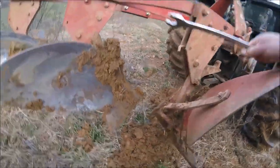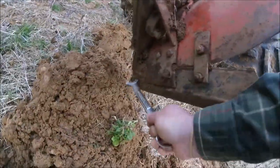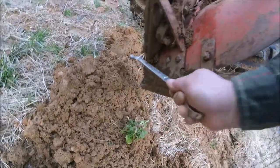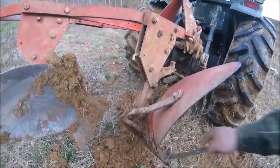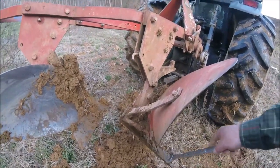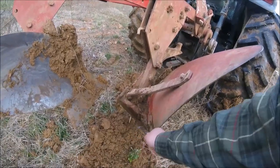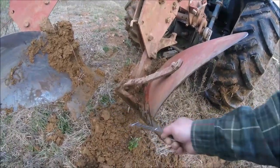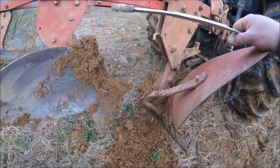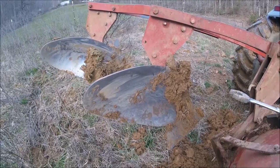If you go out and buy a set of used Ford plows, right here is your frog and you can look and see how much it's worn. This is your landside and that's going to need a landside. We've got to get these parts in for it. But some of these Fords had different bottoms on them — some of them used the Oliver point plowshare versus the Ford, so that's something else to keep in mind if you're out looking. But that's all there is to tripping them.